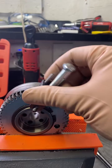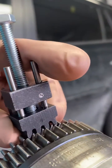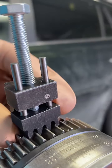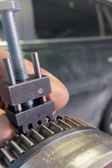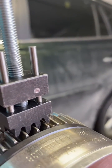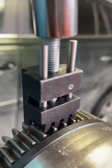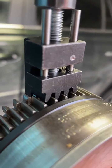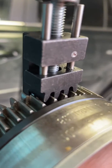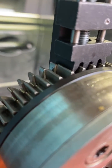And that little pin goes through here. But when you are aligning the two, you have to make sure that the gears go in this way. And when you have that started, what you will find is as it clamps down, the lash gear — like it's doing right now — it's straightening out.